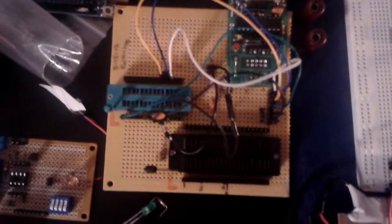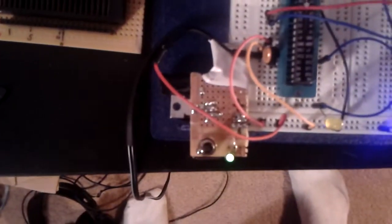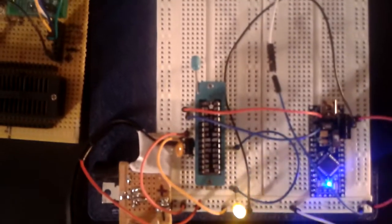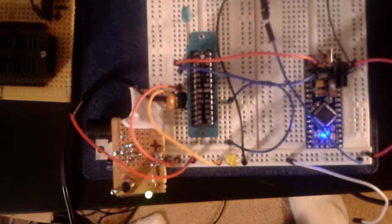The programmer has a 16 megahertz crystal set up for an ATmega 328 — that's the Adafruit USBtiny programmer. The power supply is on the breadboard, with the 328 chip and an LED on pin 13.